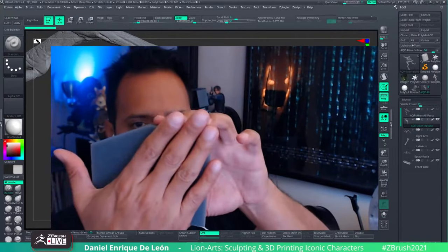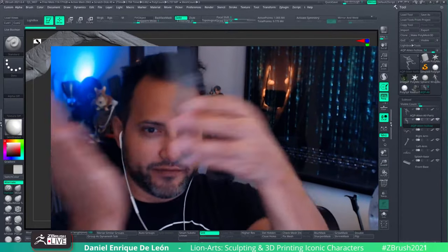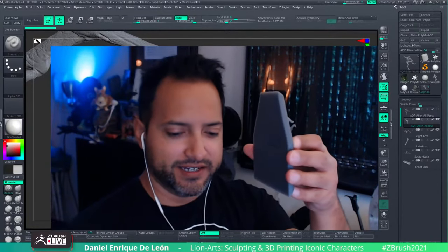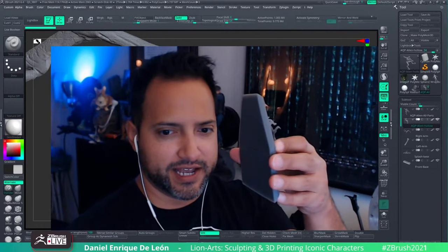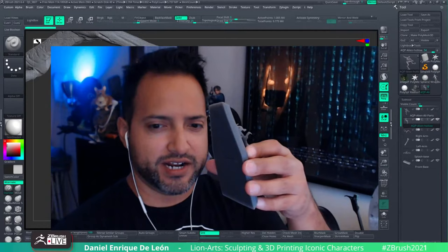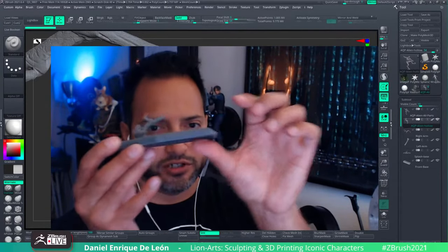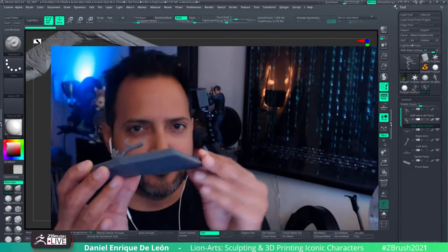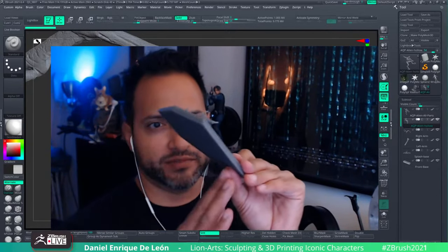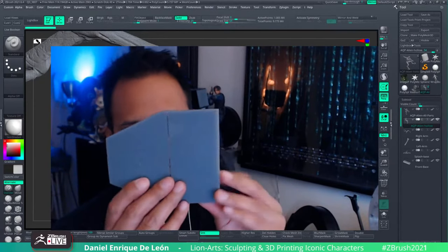And also, being that flat and large of a surface, you have to pry that off of this metal plate. If there is any kind of extra adherence to the plate, it's going to create a problem for removing it, right? So that's why usually, even with large flat surfaces like this, you want to angle them, so you have them diagonally printing, with all these supports coming up to them. That's how this version was printed.